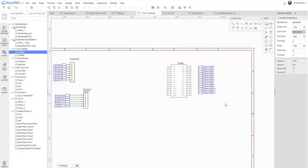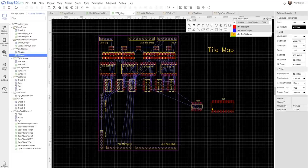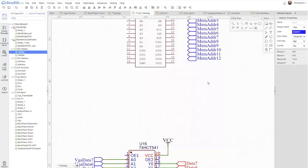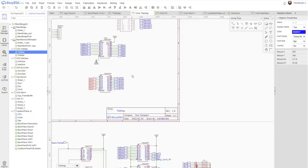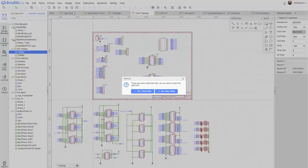The only other thing I can suddenly think we need is a 541 to conditionally push mem data onto the RAM chip's data lines. These will need to connect to the I/O lines here, but in whatever order we feel like. Okay, we've added the 157s, the line driver and the latch. So I think that's all the chips that we actually need in this circuit. We're going to need some capacitors, but we can probably approximate the layout now.